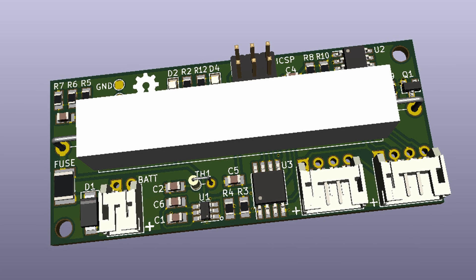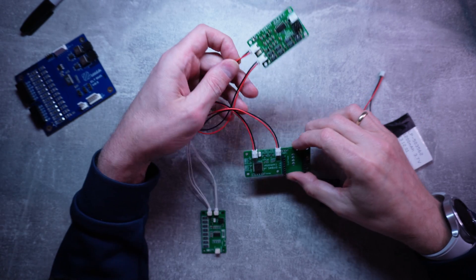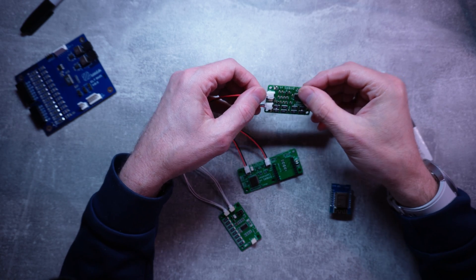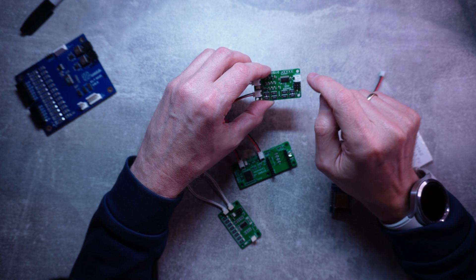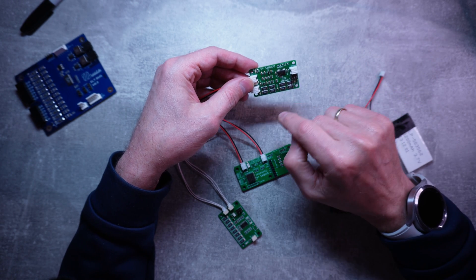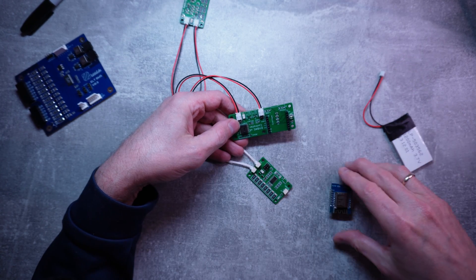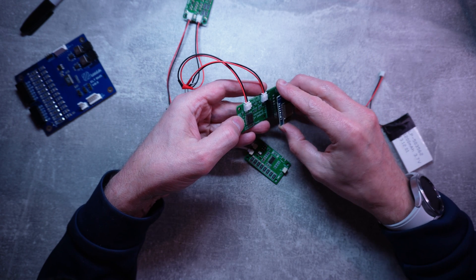The DIY BMS was developed by Stuart Pitterway. Its design is based on a slightly different principle — it has separate modules, and each module has an ATtiny which measures the cell voltage and accordingly controls the charge and discharge functions. Each cell communicates through the ATtiny chip to the central control module, which is based on a WEMOS D1 Mini — basically an ESP8266 module. The software runs on the WEMOS D1 Mini and provides visual indication of state of charge, state of health, and charge or discharge level of individual cells.